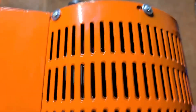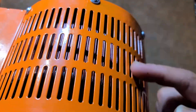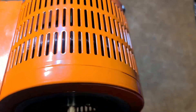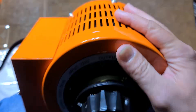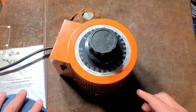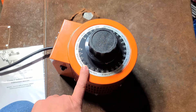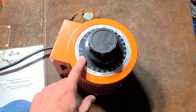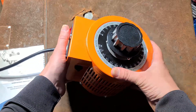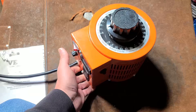I'm not going to totally open it up, but how they work is they just have what looks like a big toroidal transformer in it. Instead of being a fixed ratio, you have this knob with a little carbon brush wiper that rides on the tops of the coils. As that carbon brush transitions over the tops of the coils, it changes the ratio of the transformer from basically zero all the way up to a little bit over — in this case, 130 volts. Some more laboratory-grade ones will go higher: 140, 150 volts.